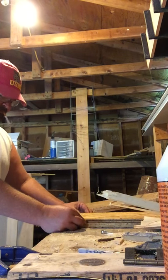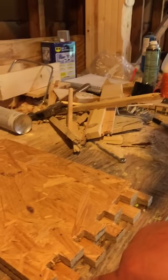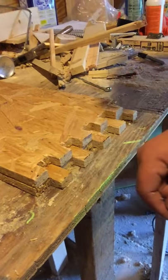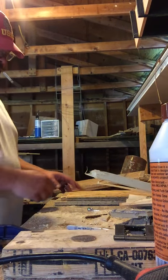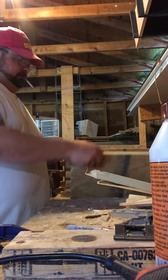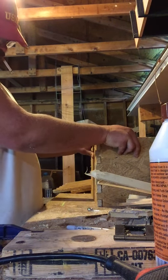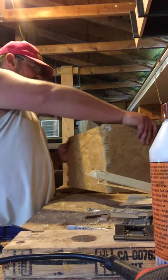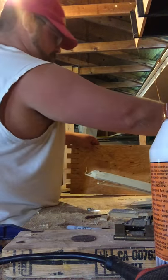Now if you need to make adjustments, the best way to do that is lay one board right on top of the other one. Make sure that everything is flush, otherwise when you make your adjustments you're not making good adjustments and your box will sit cockeyed.